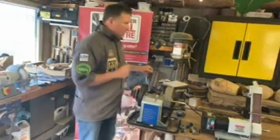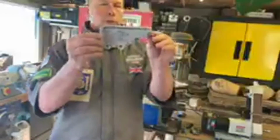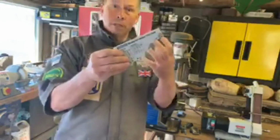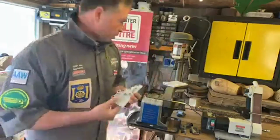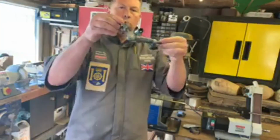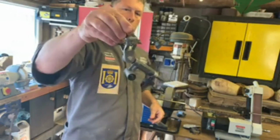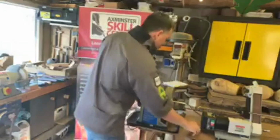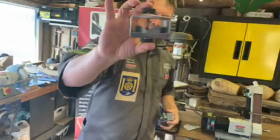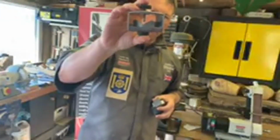We've then got the TTS 100. That's the Tormek tool setter. And this is crucial if you're a wood turner for setting everything up the same each time. And then we've got our actual bowl gouge jig. Again, for a wood turner, a central piece of kit, that's the bowl gouge jig, this one. And then one other piece of kit, it is actually part of the multi-jig, but in its roughing gouge guise. So there's a little saddle in there. That all comes as part of the main multi-jig kit. That's for our roughing gouges.